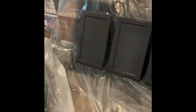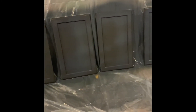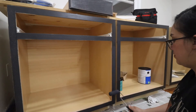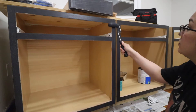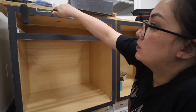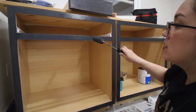When it came to repainting the cabinets, I decided to go with my favorite black paint, which is Benjamin Moore's Black Beauty. We went with Benjamin Moore's Regal Select in a pearl sheen finish, and I am so happy with the results. I used a paint sprayer for the doors and a foam roller for the bases and drawers — using the foam roller gives it a similar finish as the paint sprayer.